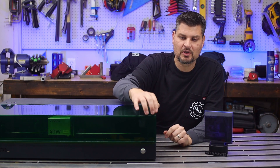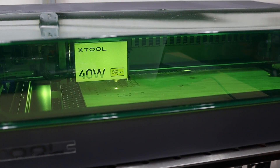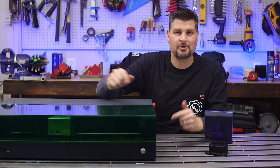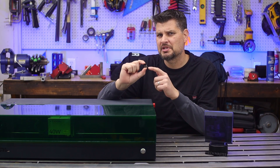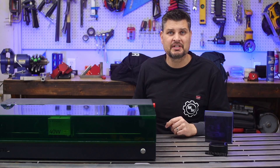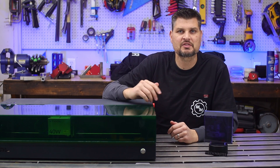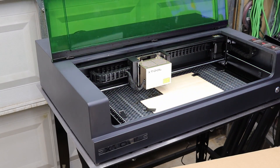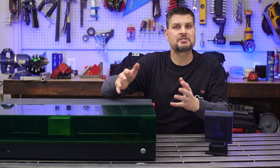You might notice this nice green-tinted enclosure — that's on purpose. It's got protection built in to protect your eyes from the blue laser, and it works well. With open-top lasers you need glasses if you're going to be looking at the laser beam, but with this one you can stare away. It's got a key to lock it — it's a USB-style key and I'll just always keep it in there — and of course a red safety push button for an emergency stop if something catches fire. If you're mid-print and want to check progress, you can lift the lid, it stops the engraving, you take a look, close the lid, hit resume, and it keeps going.